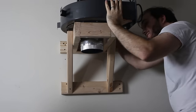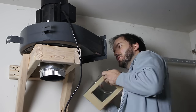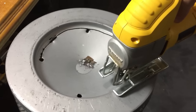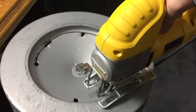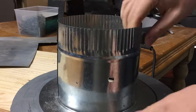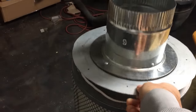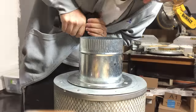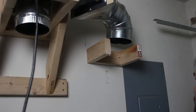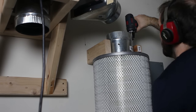To connect a large cylinder filter to the outlet I added a square of plywood to a duct transition and mounted it to the blower with half inch screws. Before mounting the filter I needed to open up the bottom, so I cut a six inch hole with a jigsaw, then cut a mounting plate out of sheet metal to allow me to mount the six inch collar to the filter with liquid nails and half inch screws. The filter was held in place to the wall with a simple 2x4 bracket attached to the wall studs, and then I attached the filter to the bracket through the top with screws.